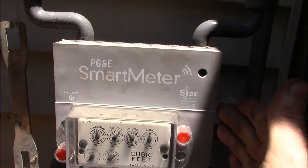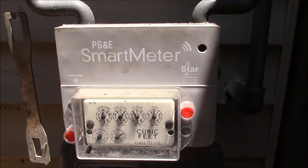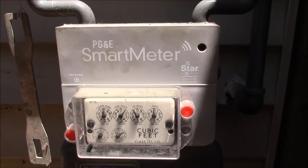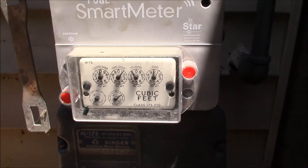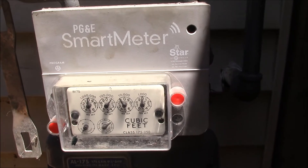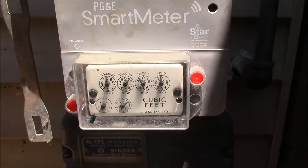This uses what they call the STAR network — it's a rather low, licensed frequency that they transmit on. Apparently these things can transmit up to about a mile away, so they usually have receivers located on a half-to-one-mile grid around the area. They transmit something like four times a day with all the pertinent data.